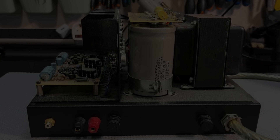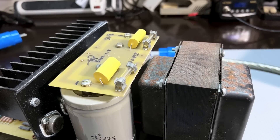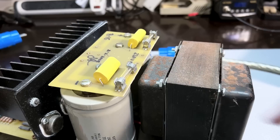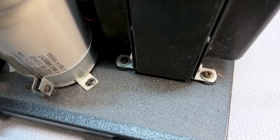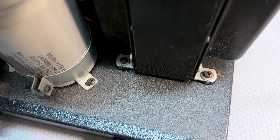When we take the cover off — it literally comes off by removing two screws on either side — this is what we're left with, and this is where you start seeing the problem. The owner lives right by the seaside in Madeira, and we get a lot of sea air which obviously has a lot of salt in it. With salt air comes rust. Our transformers have got a fair amount of rust, and even the screws down there have got rust on them. They'll have to all be removed and de-rusted one at a time. You've got to be careful when you're playing with these things — you can actually damage it more than you fix it if you don't know what you're doing.